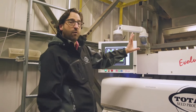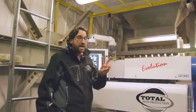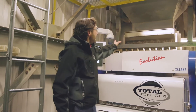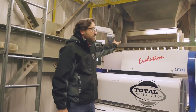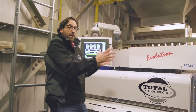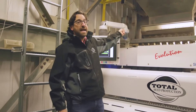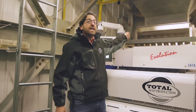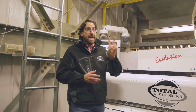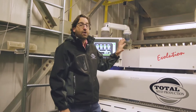What's unique about this machine is that seed has to be discarded twice in order for it to be completely discarded. These are all set up in channels, and this far left channel is a rerun channel — all the product that gets discarded the first time gets routed back to that separate channel and runs through again. So a kernel of corn has to be identified as bad two times in order to be gone for good.